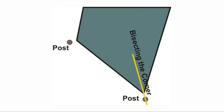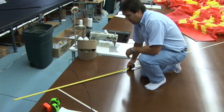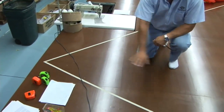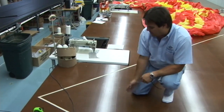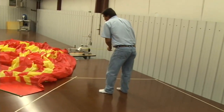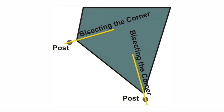This illustration shows the post in the correct spot. If we were to have the post in the wrong position, what would happen is we would get great tension on one edge but no tension on the other, and we would end up with a lot of sagging in the material along that edge. If the post were moved to an incorrect spot, you would likely get a sag there. So again, roughly bisect your angles, and you'll get tension on both edges and have a nice, taut structural awning. Here you can see this post is positioned correctly.